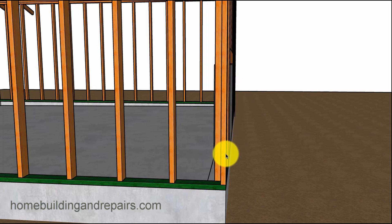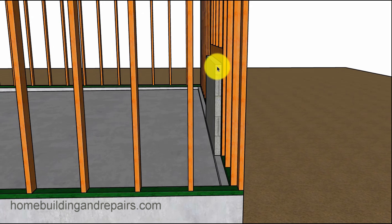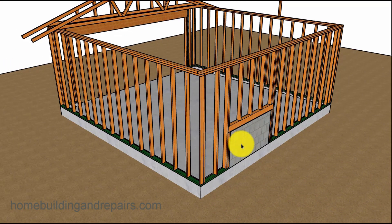Also think about whether you need the block wall surface even with the outside of the framing so you can put stucco or siding over it, or whether it needs to be framed so the interior wall is even for drywalling the inside. It's not uncommon to have a situation where a block wall is 6 or 8 inches and the framing is 3 and a half inches.